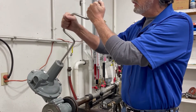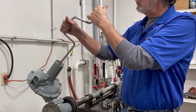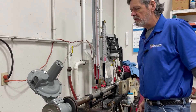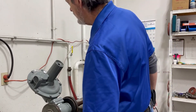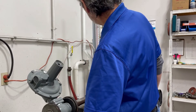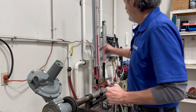When we are reinstalling our spring button, make sure that you do not cross-thread it. Make sure that it is properly installed so that you do not have any problems increasing your pressure. At this time, we're going to go ahead and energize the regulator, and you will see an increase on our manometer.